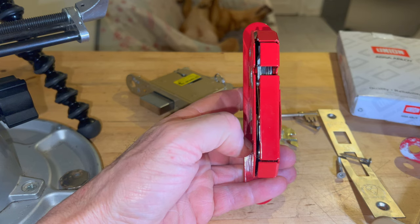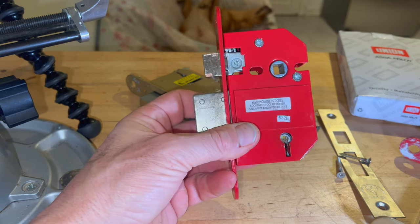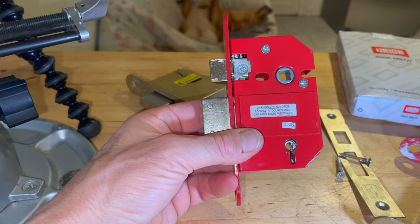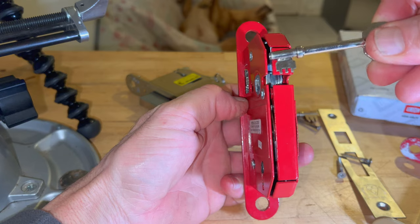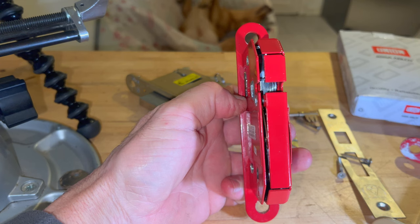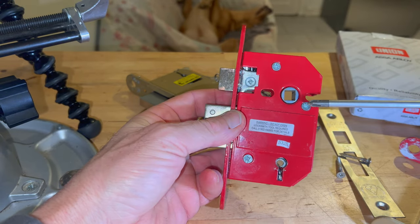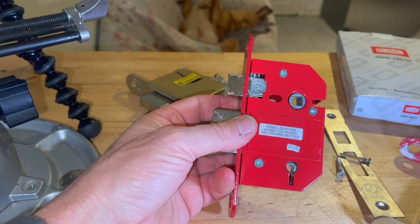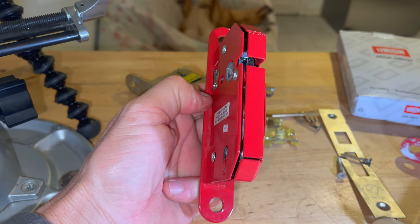Sometimes this gets really bad and you have to literally drill the case and manipulate things inside or try to put things back together — it can be a tricky one if it's gone too far. I got lucky today and was able to open it and see the problem quite easily. Also, when you pull one of these out of the door, where the back of the case has opened out it can get jammed, so it can be quite a struggle. Always check that the cap screws are tight and give them a little tweak before fitting the lock, otherwise this could be the result — and an expensive callback.